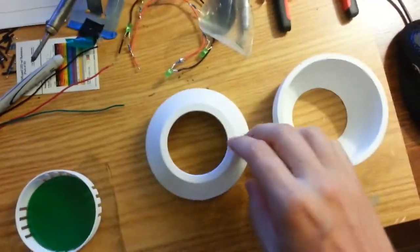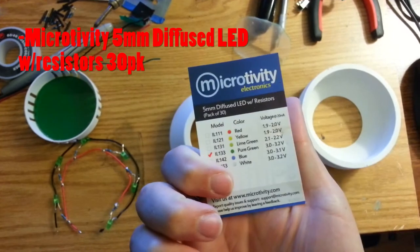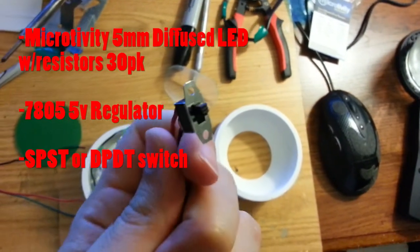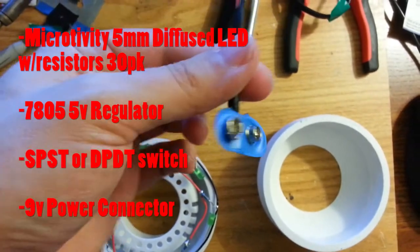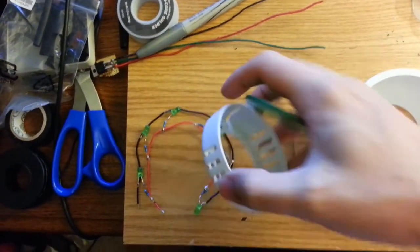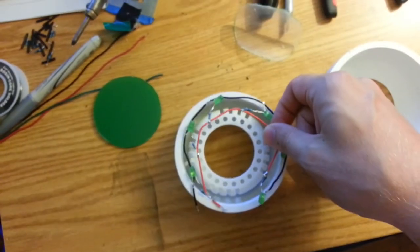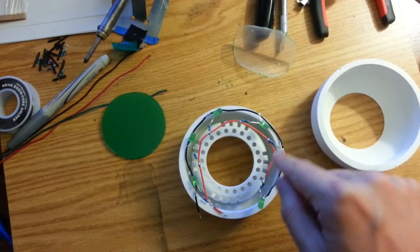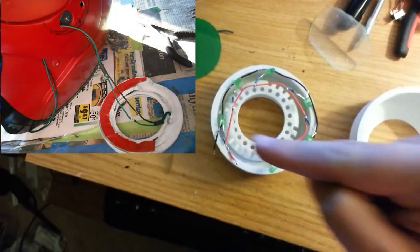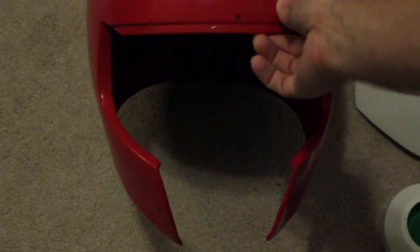Here are the three main parts of the ear. For the LED version of this project I've simply wired LEDs with resistors in series. I bought LEDs and resistors in a pack from Amazon and wired them to a 5 volt regulator that runs from a 9 volt battery. The battery compartment is usually cut into the foam part of the helmet interior.